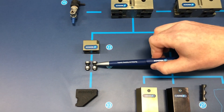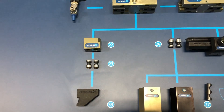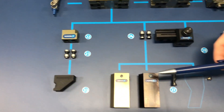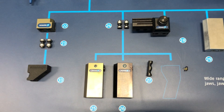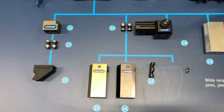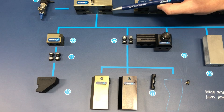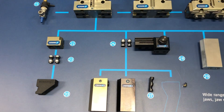There is a hex screw on the side that you lock in place and you're good to go. This can be for rapid change out of different fingers—as your parts change, you can change fingers just as easily. Here we have the BSWS-ABR and SBR. These are a variation of that initial system, but in this case you have the locking mechanism in the finger itself as opposed to a separate body. Here you have these finger blanks, which can be machined for your part, and the pins mount directly into the gripper jaw, keeping the overall stack a little smaller.